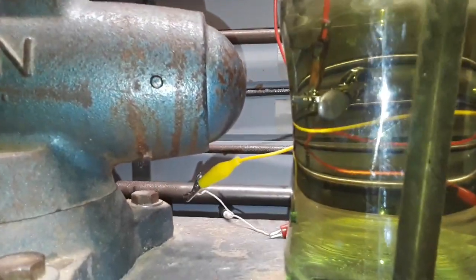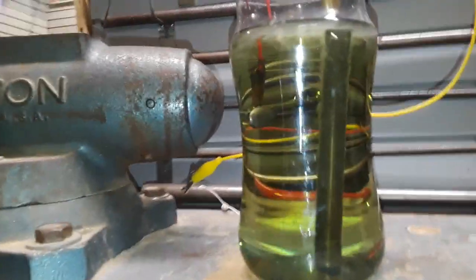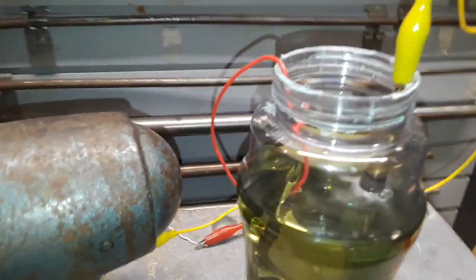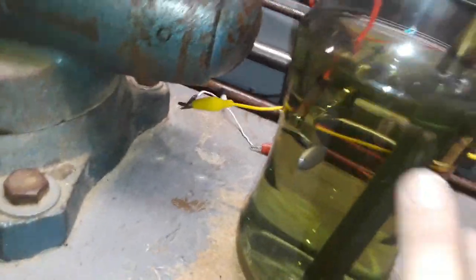This will take a little while but it won't take hours — probably about 10 minutes. Electricity flows from positive to negative, so the key is hooked up to the positive lead, and then the brass tube — you could also use copper or even another nickel tube — is hooked up to the negative.